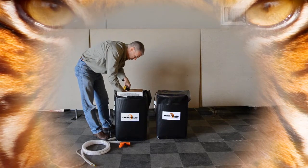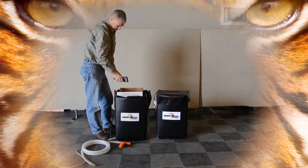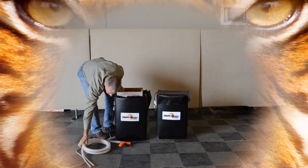Make sure you warm your tanks up to 85 degrees Fahrenheit and check the heat with an infrared reader. If the spray foam becomes too hot, the application will not be ideal. Wait for the product to cool down to the optimal temperature before proceeding.